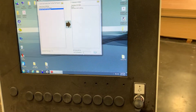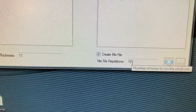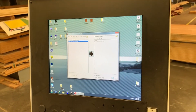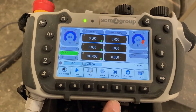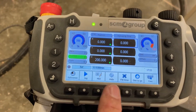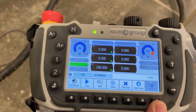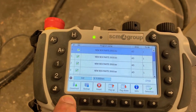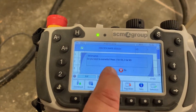We selected 10 repetitions. We only have to do this once for every 10 parts we make, and we could select 100 or any number between 1 and 100. The important part with downloading the program — don't forget to push auto first, then execute second. Then we download the file by pushing the download button, and to overwrite the previous one, we push OK.